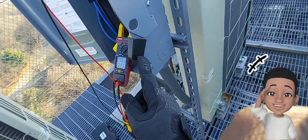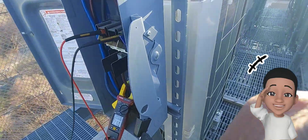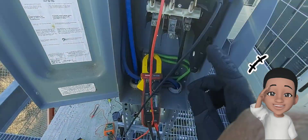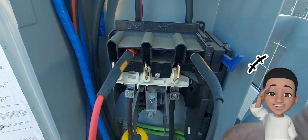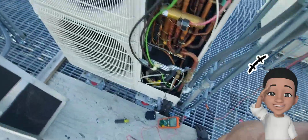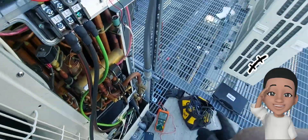This is my service disconnect — as you can see it's in the off position, it's knifed off currently. Got my meter rigged up. Power line voltage is 216 volts, so I'm good. But if I put this on it will trip the main breaker downstairs.